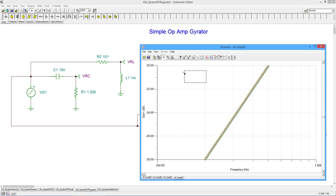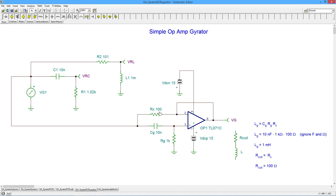Okay, put the thing out here. So VG, which is our simulated inductor right in the middle, that's the maroon one. That's the guy that's right in the middle of this, right? Because that's the one I didn't monkey with. That has the exact values, okay? So the L is exactly 1 millihenry, and the R is 100 ohms, rather than being like 101, right? And so forth.